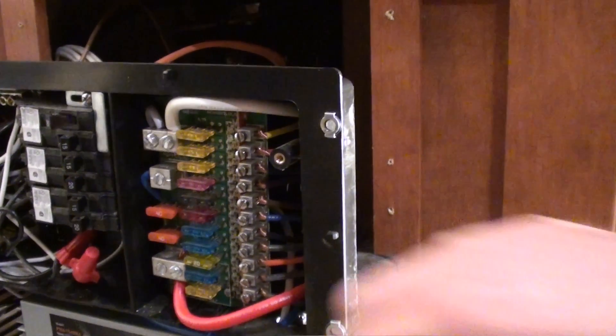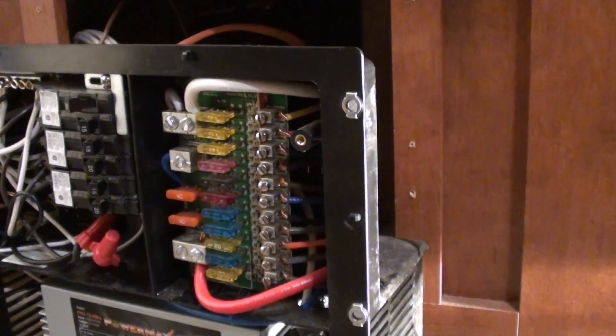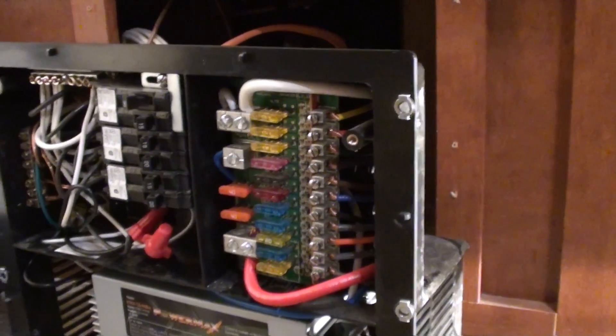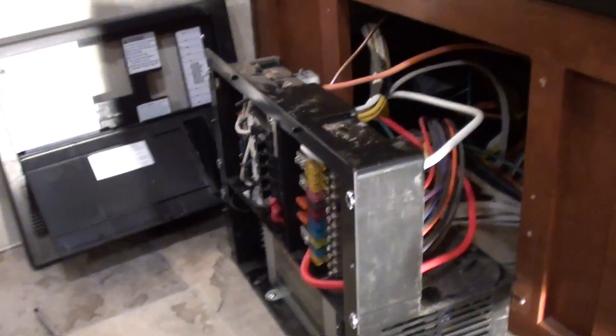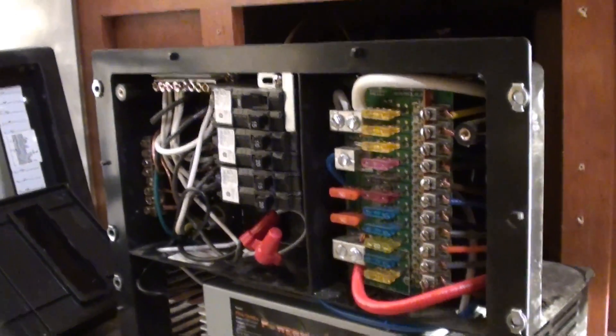This gives me the largest wire leads possible without running brand new cables all the way to the battery. Just to note: for a larger inverter install — 1000 watts, 1500 watts — you're going to want huge cable, at least 2 gauge, and a short distance to the batteries, ideally two or three feet.